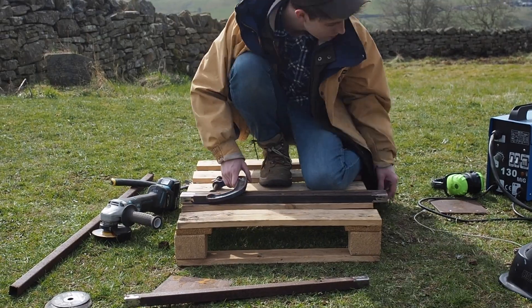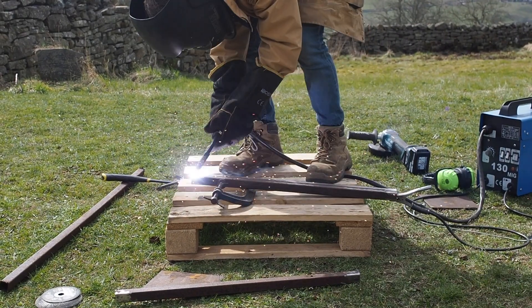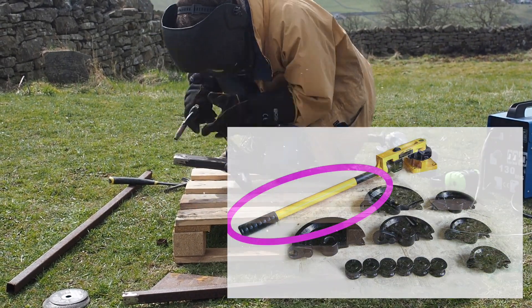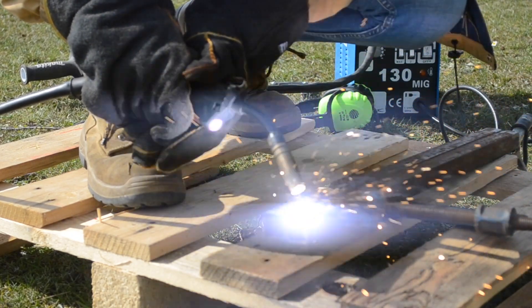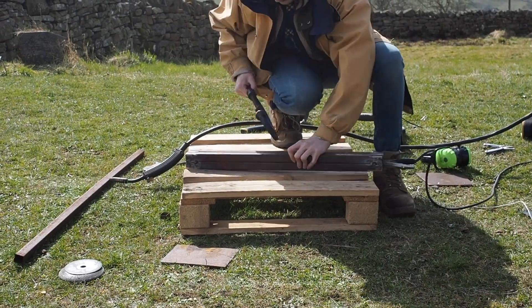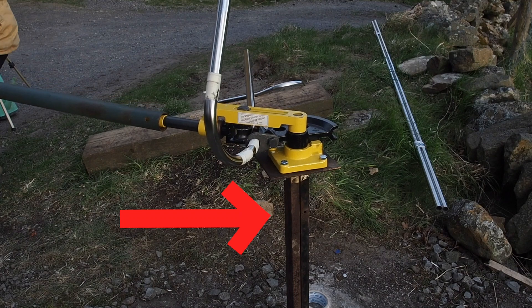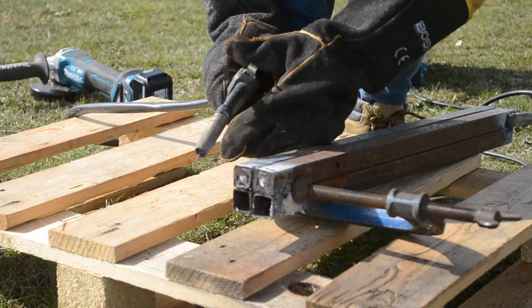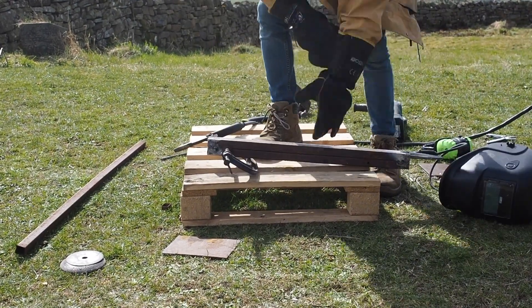In the description of these tube benders they say they can bend tube with a diameter of 25mm and a wall thickness up to 2mm. First of all, this is extremely difficult to do with the handle they provide — the leverage is just inadequate. What I actually did was take about a 2-metre length of steel pipe to extend the handle and get enough leverage to physically force the roller to bend the tube. Obviously that puts a lot of force on the tube bender and on whatever you've mounted it to — that's why in the video you can see the stand flexes quite a bit. Whatever surface you mount it to, whether a workbench or the same as me, it's going to need to be extremely sturdy.